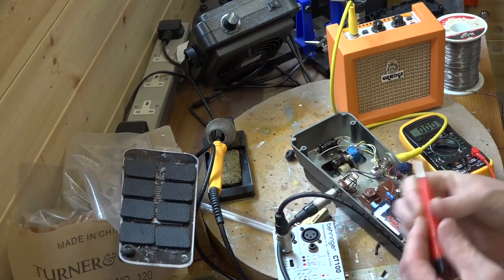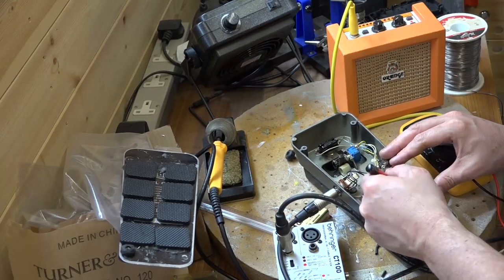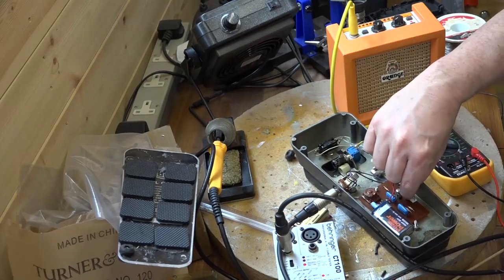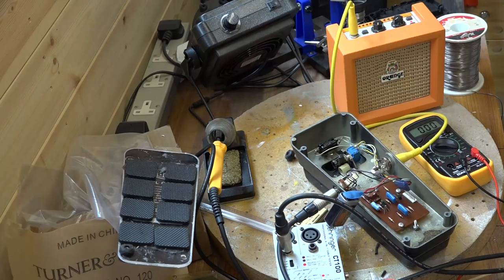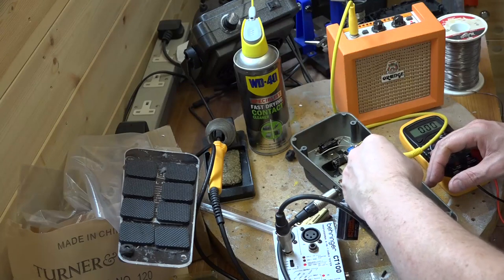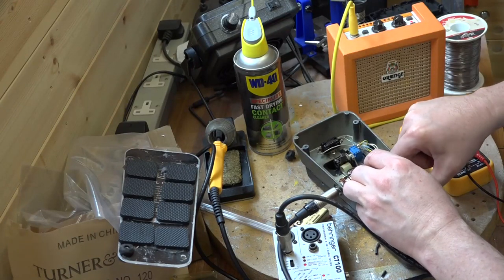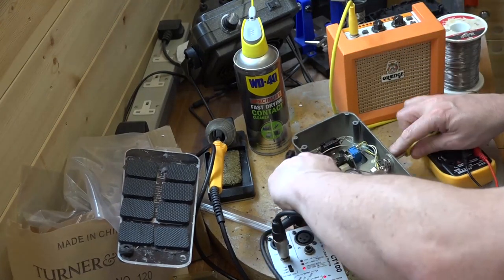This is a fiberglass pencil and it's very good for cleaning terminals and connectors. I use it a lot for cleaning the legs of silicon chips and ICs, particularly if you've got old stock ICs and you don't quite know where they've been. I'm also going to grab some contact cleaner and very lightly spray the socket, then pop it in and move it up and down a couple of times. It's still not quite right, but we know that's where the problem lies.